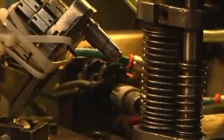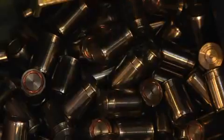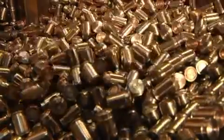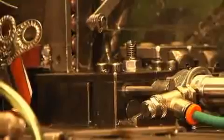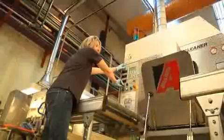Copper rings are pressed into the armature tops. These will dampen the armature vibrations when AC current is used. After pressing, the pole faces of the armature tops are machined to have a smooth, even surface. Next, the completed armature tops are washed to remove all dirt and oil particles.